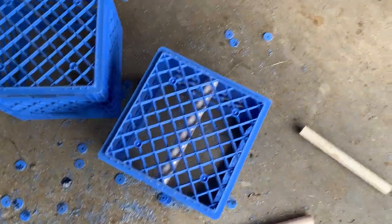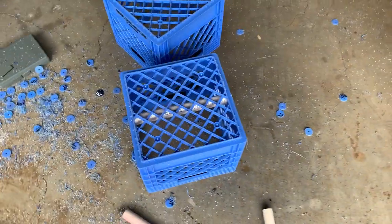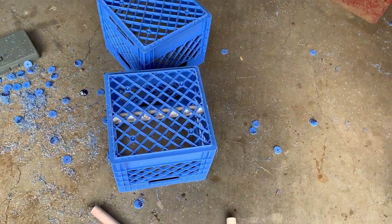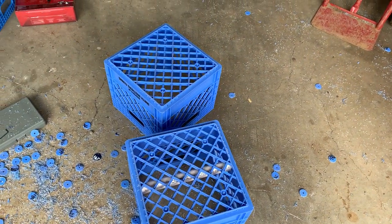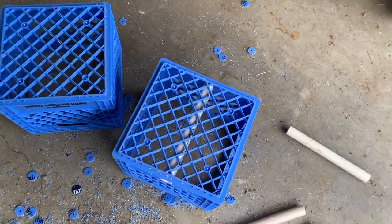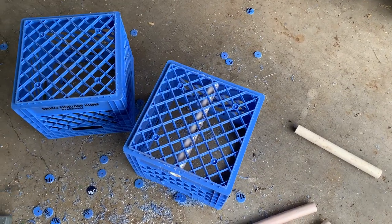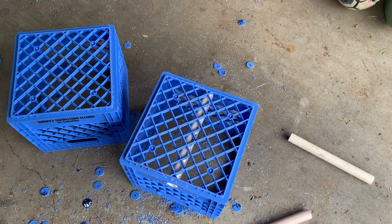You've got this piece of one inch PVC as a support across this netting. In a wetland filter, I'm going to end up with about 24 inches of gravel on top of these. I don't think it makes a huge difference — the weight is probably spread out enough over two feet of material to not put any real point load on this weaker spot on top. But just as some extra reassurance, it's real easy to do and really cheap. It gives a lot of strength to the top of the crate and distributes any point load a little bit better.